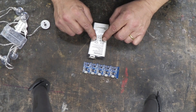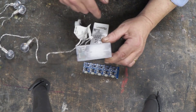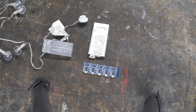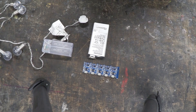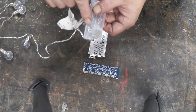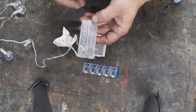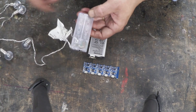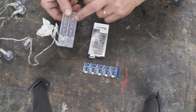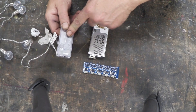These batteries actually work at 3.85 volts — that's the nominal voltage. When we look at a device like this, it's got two AA's in there at 1.5 volts each, so three volts — we need three volts for this, and we've got 3.85 volts going out, which is a bit much. But to be honest, most of the time it really doesn't matter. If you're doing something like a torch, that extra little power is completely unimportant. For more sensitive electronics, very often there's a little board inside that takes care of that, because normal batteries rather than being a straightforward 1.5 volts are in fact all over the place. The electronics make sure the circuit gets what it needs, handling a massive range of voltages, down from about 2.5 volts up to about 5 volts. So the voltage mismatch isn't going to matter a jot, as long as you're roughly in the range.